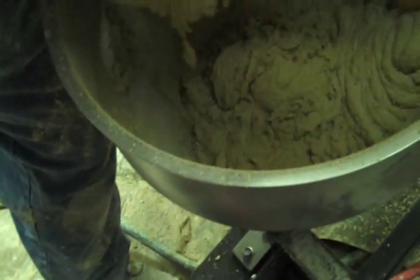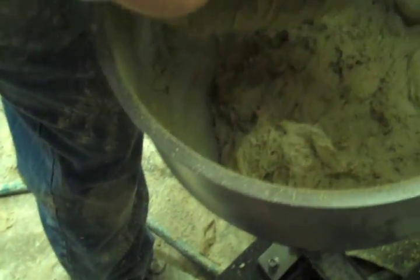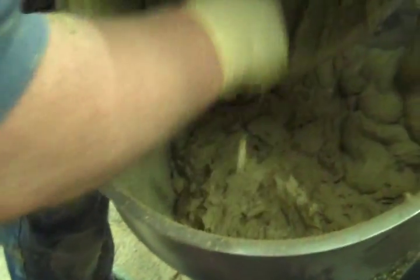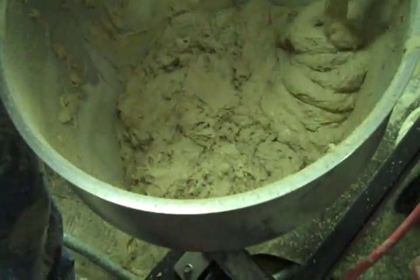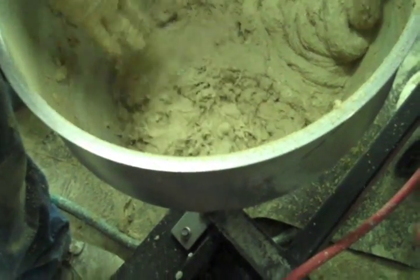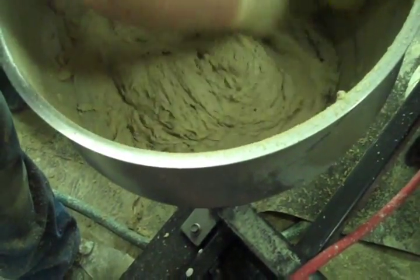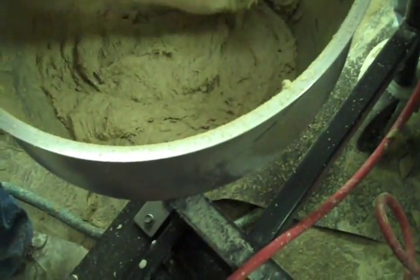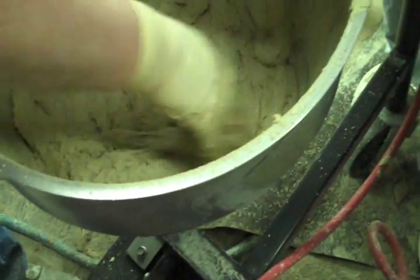What about when you spray? We're going to be down around one and a half. If that's zero to ten, you're going to be right about at the end of this white dot right there. And he's feeling for clumps while he's doing this — making sure you don't feel that snot or that crosshatch piece of fiber that's going to bridge across the inside of the gun.